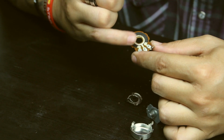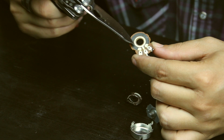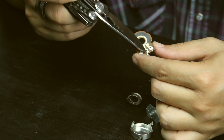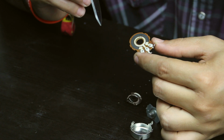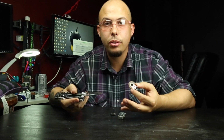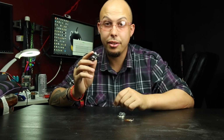So let's look at this one first. We've got what I said before where we have pin 1 all the way around to pin 3 is a consistent change over time, right? So this is going to be our 10K, but this middle piece goes to a ring that hugs just inside of the semiconductive material, but it doesn't actually touch it. It is just providing a ring of conductive surface, and that's ultimately, when we deal with electronics, what we're managing is conductive surfaces or voltages and how they are affected by these conductive surfaces or semiconductors. So with that being said, let's look at the next piece.